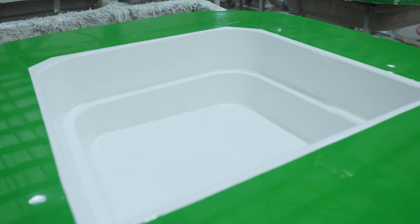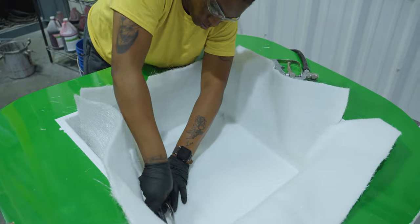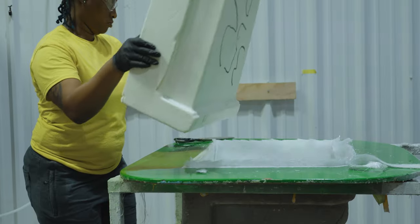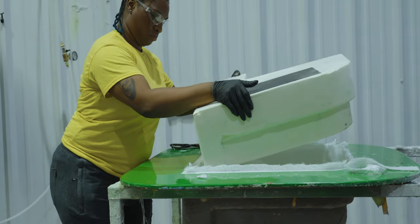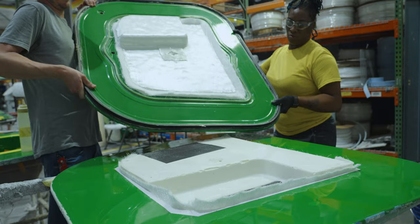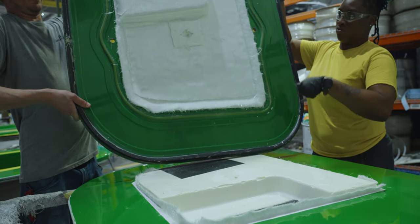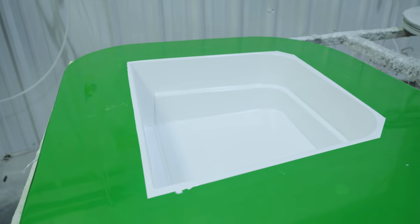One part that we manufacture using light RTM that you may not realize is our side entry doors. The advantages of light RTM are perfect for manufacturing doors. The one challenge is that doors are very thick, so they do require an inner foam core. The doors also require a layer of gel coat that matches the hull side color instead of just being white all the way around.